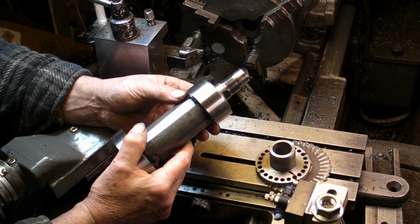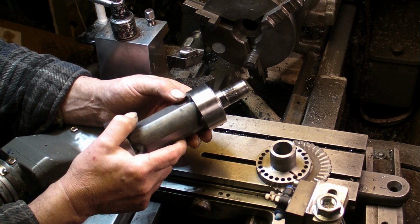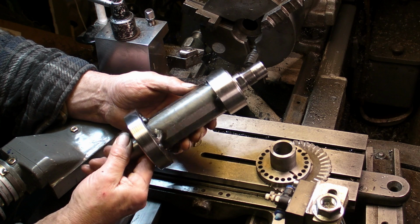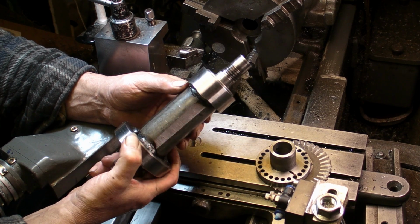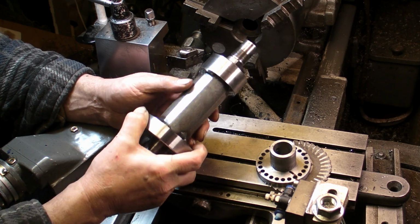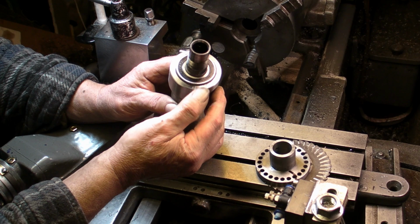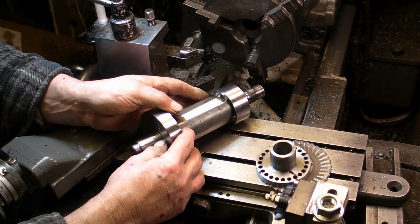And I'd like to chamfer that down. I've got some weld on there, so the intention is I'm going to mount this in the wood lathe, and as it's rotating I've got a flat disc on the angle grinder, so I'm going to use that rather than a carbide tip in the lathe, just to take that corner off, that sharp edge. This side I've done on the lathe with a file, so that's that.